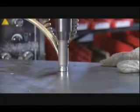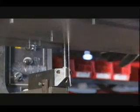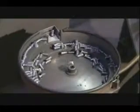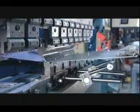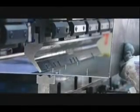The laser cutter also makes a series of holes in another cabinet part. Then workers press threaded studs into the holes. A vibrating feeder dispenses the studs into the insertion machine they use. Now they bend the sheet, again using a press brake, and make the three-sided panel that will become the cabinet sides and back.